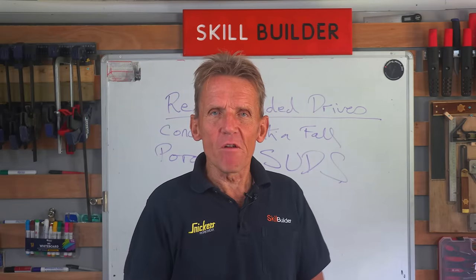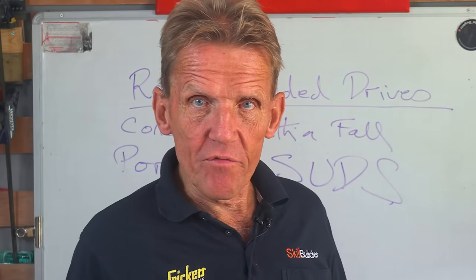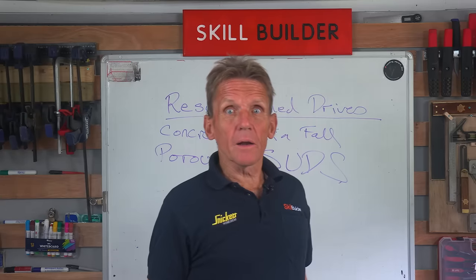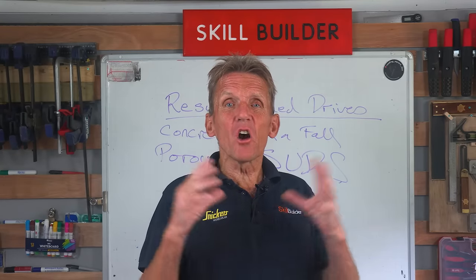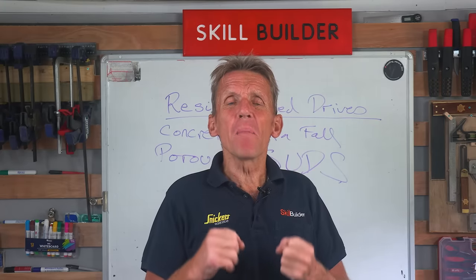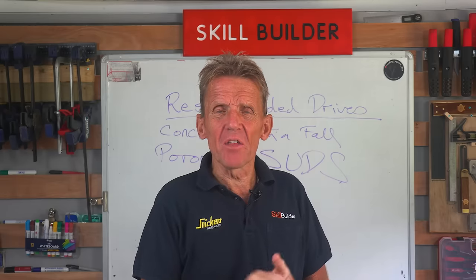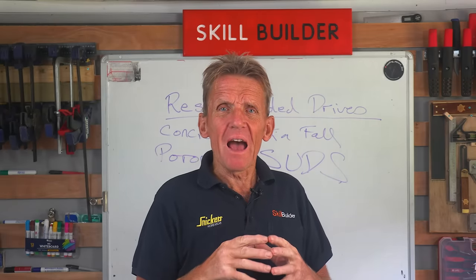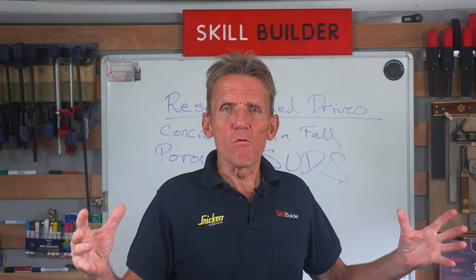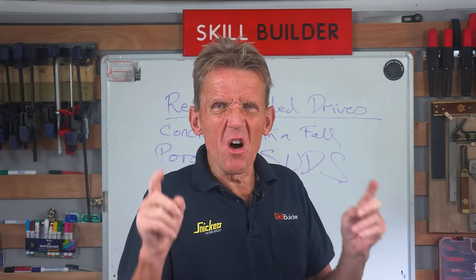So very, very important point to check out and to guarantee your driveway, if you need it, is going to be UV resistant. And of course, it isn't only a cosmetic consideration, because that UV degradation makes the material a bit more brittle and it cuts down the life of it. So you really have to think about that as well. If you want a long life out of your resin drive, then you really want to choose those materials which are UV resistant.